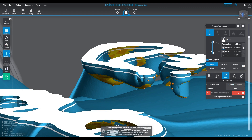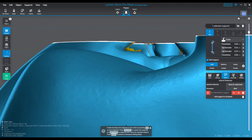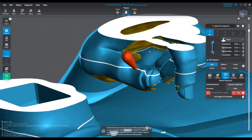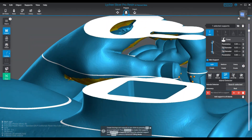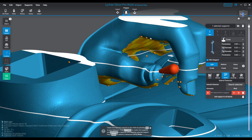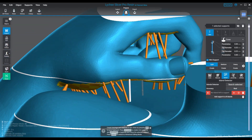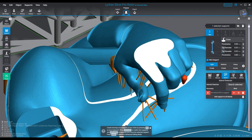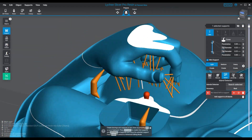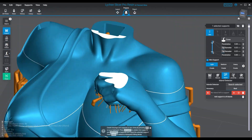This hand will wind up with a lot of little mini supports on it. Although it looks crazy and I'll probably need an exacto knife when it's done, it's fundamentally necessary to support the hand like a little porcupine because it's sitting just ever so slightly above her chest. That's going to create some gapping and cause a problem if we don't allow supports in there to help - and these are things you might miss if you don't go layer by layer.